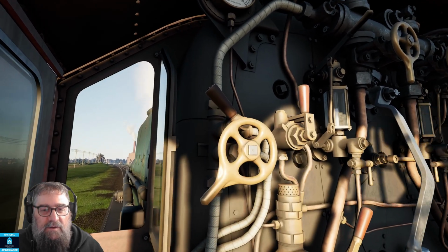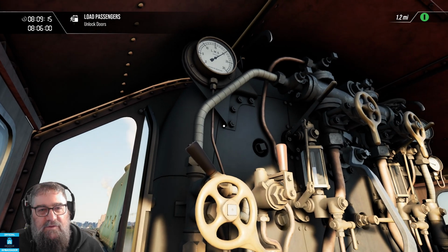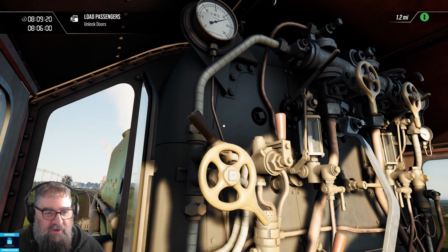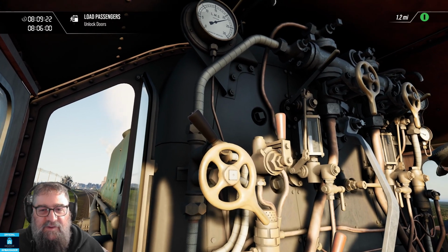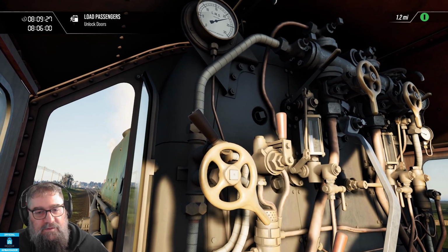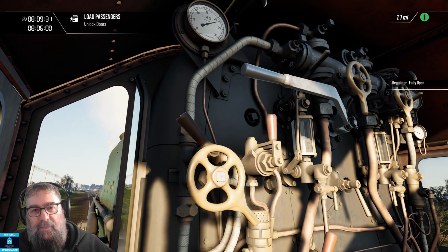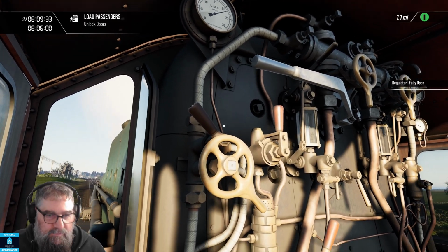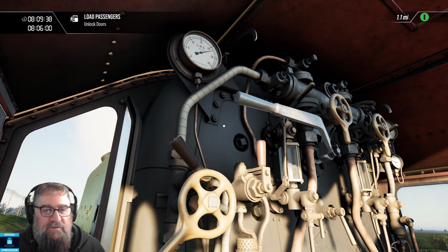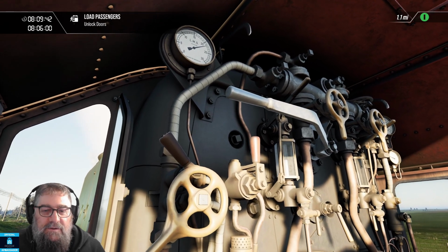But remember, if we really want this, then we have to open up the large ejector. Otherwise, you're still going to stop because it takes so long for the pressure to go up that the rest of the train's just going to pull you to a stop. So let's accelerate again. Let's just put the regulator on the roof. Now we can shut the large ejector again because it has pulled the vacuum, so it's fine. I shouldn't keep saying pressure, it's wrong.